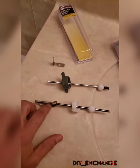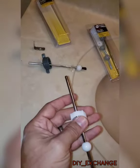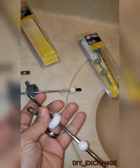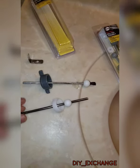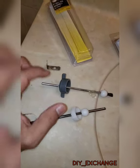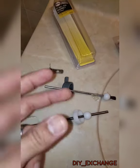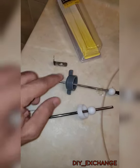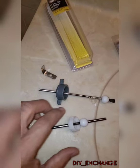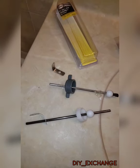I'm going to keep this unfastened with just one of the holes through the rod, and once I get it past the bracket in the back underneath the sink I'll lock it onto the rod with the bracket connected. I also have a choice to use the new cap or just use the original one that came with the unit - the threads should be the same. I like that the new one has nice wings to lock and unlock the cap, so I'll go ahead and switch those out, then connect it underneath and show you the final stages.